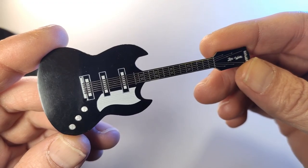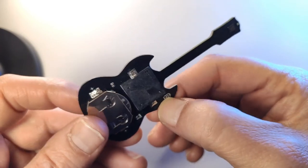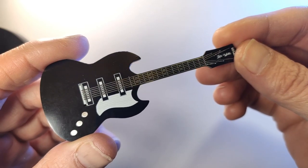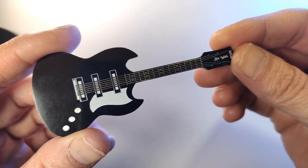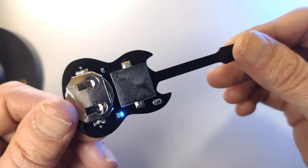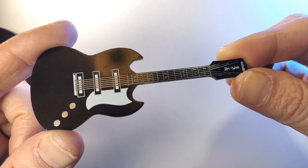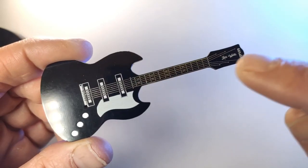In the final version of the software, the clock is not divided by 6 to get 3.3 megahertz — it's just running at its maximum speed. That's because an 82 hertz tone through this tiny little speaker doesn't sound really good. So the tones are still proportional to each other, except they're a little bit higher.